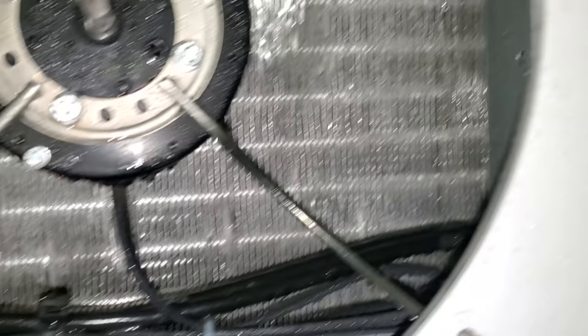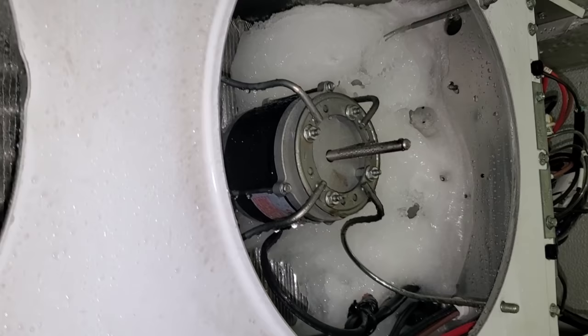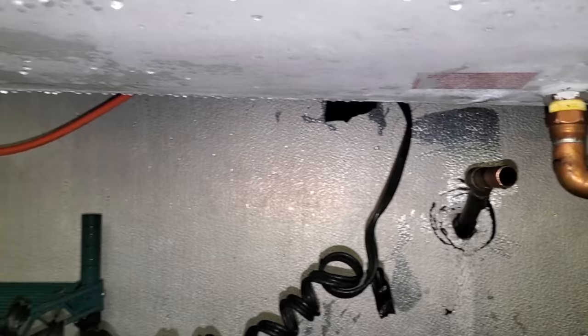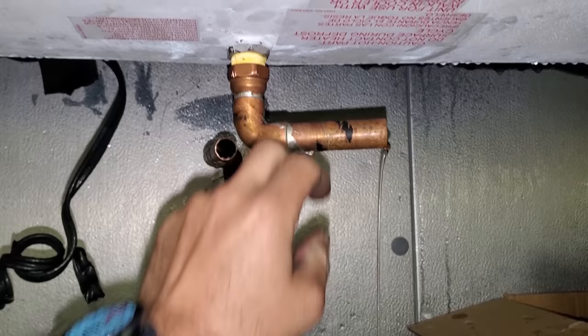You can tell from the backs of here that this thing has been iced up a million times - reflected in all the previous invoices. They've iced this thing up so many times. I think this is the original motor, and I think the left and right ones have been replaced. I need to finish defrosting, but I need to figure out how to make this drain faster. I found a union. I broke it free and pulled down just a little bit - there was no water draining before and now look at all that water. The drain is messed up.